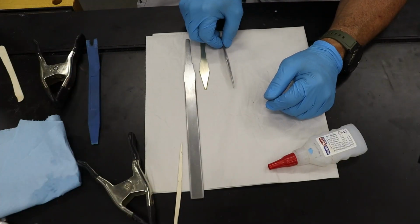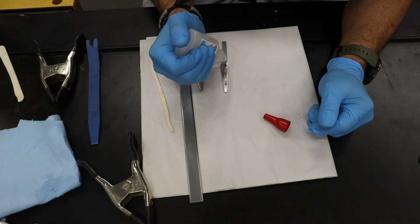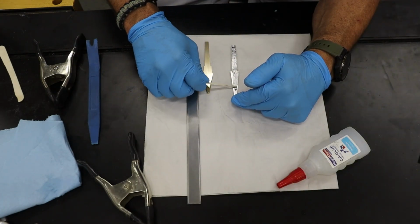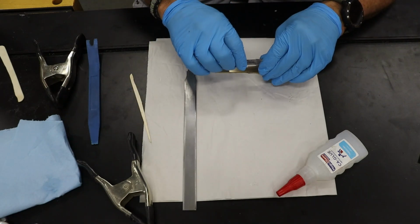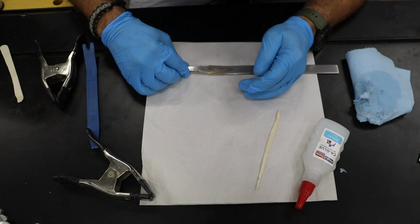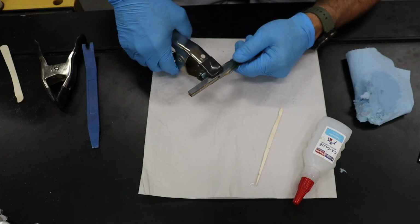With all the pieces prepped and ready, it's time to start assembling them onto the blade blanks. First, I marked the rivet hole locations using a center punch. A little tap now saves a lot of wandering drill bits later. Then I aligned the bolster pieces on each blade using CA glue or good old super glue. Just a few dots to hold everything in place while I clamped it up for a few minutes. Doesn't take much. We're not gluing a bowling ball here.